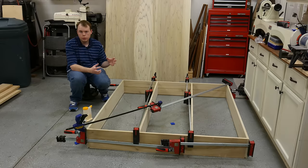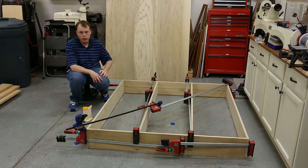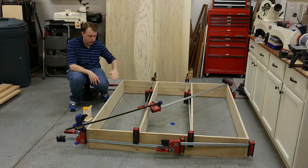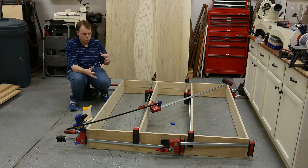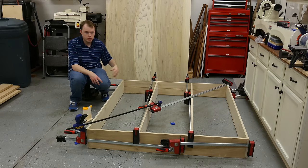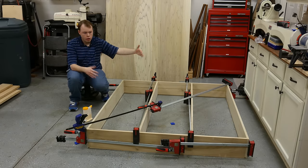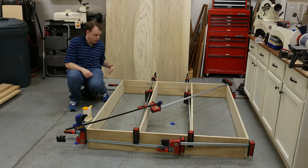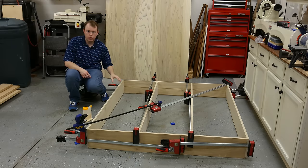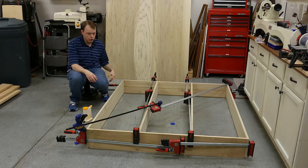I went ahead and clamped and glued this up off camera, but I'll explain how I did it to help you if you're gluing such a large piece. I had to use my garage floor, which is not flat or square — there's a crack down the middle so it's uneven. The top and bottom have two dados for the vertical dividers; I put glue in those two first, then on one side I put glue in the tongue and groove, got those together, popped the side on, then came over and put glue in the tongue and groove on the other side.